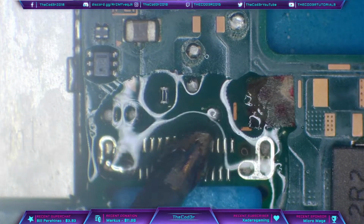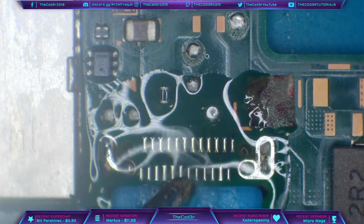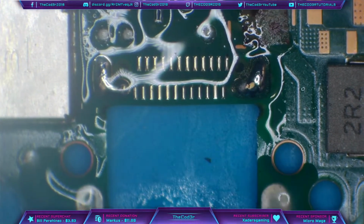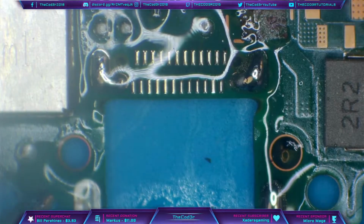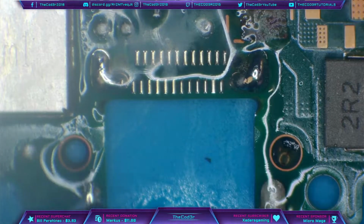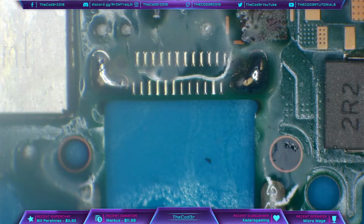The Nintendo Switch traces for the USB-C port are very fragile indeed, and all too often I see them damaged. In fact, the other day I had to replace all but 4 of those traces on one, and I also have another one in the queue with trace damage as well. So certainly not the wisest of ideas to be ripping traces. It's not easy to restore them, it's a very time consuming process, and it's not always successful.